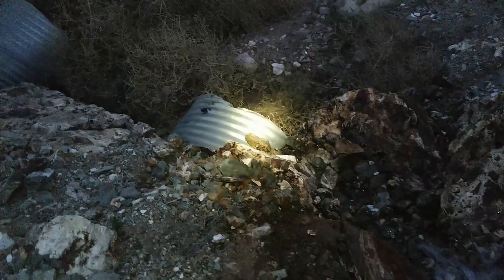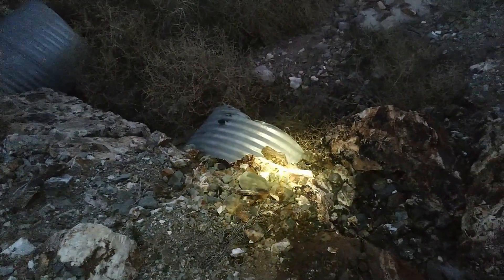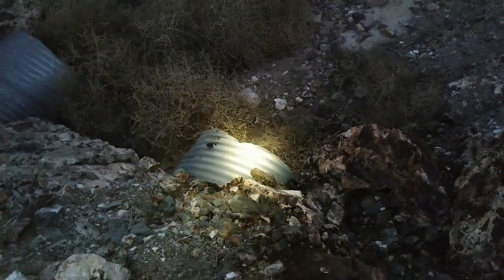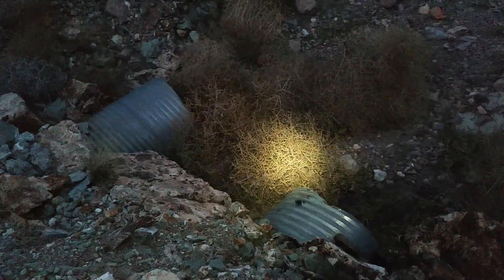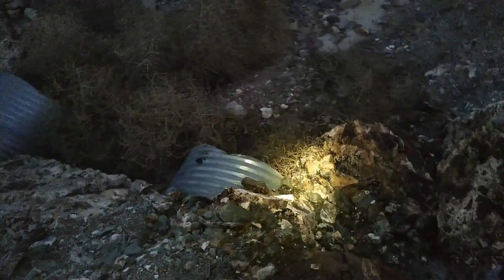We're hoping to wash some of the silt out of that culvert — it's partially plugged. We'll eventually have to get a booster pump up here and hydroblast it. I'm not really looking forward to that job. And once that's done, we ought to put like a 6-inch minus rebar screen on each of them to prevent it from recurring.